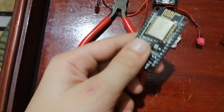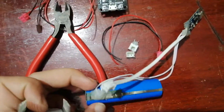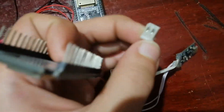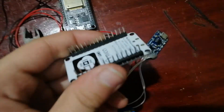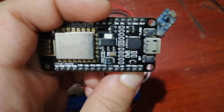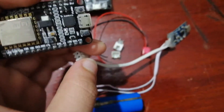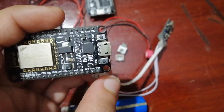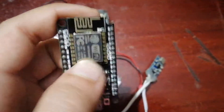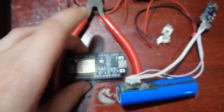I had this issue with my NodeMCU — whenever I would want to use it, this is also my battery pack which I showed you in an earlier video on how to power NodeMCU. As you can see this is the JST-XH connector which I connect to these headers, named VIN and GND. One problem I had was that I would connect it backwards, or connect GND and RST in between them, which would definitely damage the board. Though it did not damage the board, I thought over time my board would actually burn.